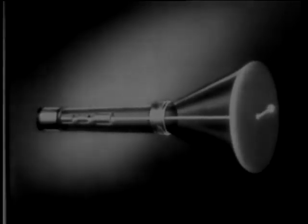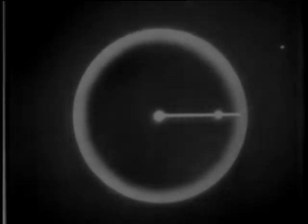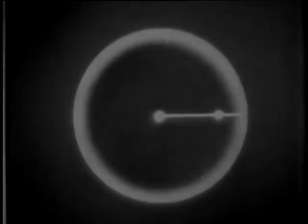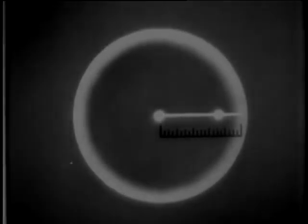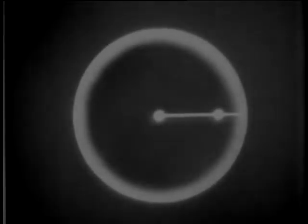Since each time the antenna is pointing at the target, there are several thousand pulses sent out and several thousand echoes return, the increase in electron flow at that point happens so fast that it forms a steady glow of light on the baseline at the range of the target. Range is measured out from the center of the scope, just as though a range scale were placed beneath the baseline. That blob of light in the center is the same as the main bang on an A-scope. The second blip is the target signal, and range is the distance between them.